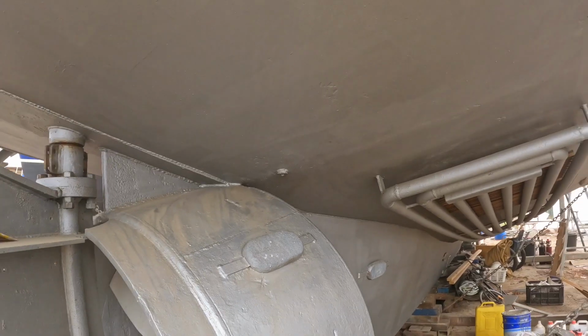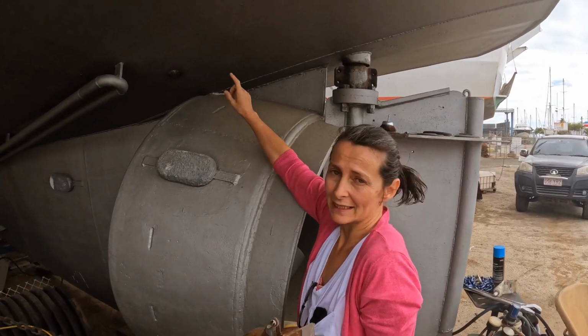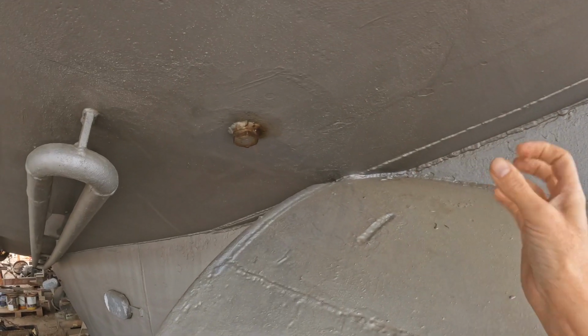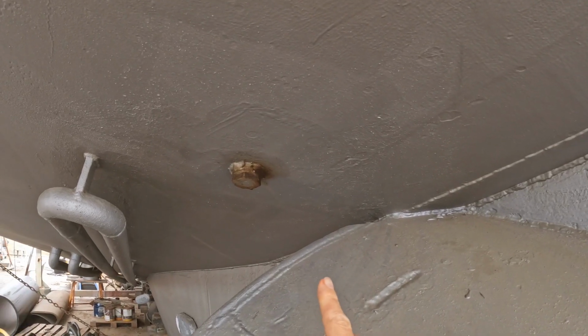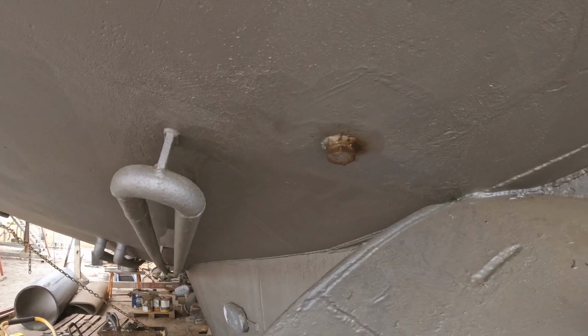So we'll look for that regardless. And that's how we figured out we have a slow leak on this other tank over here. This is what made us think that there's a leak here. You can see the bung itself, all the dirt from the yard has clung to it. That means there was some moisture that it clung to. Around it you can see that it's all dry, there's nothing. But you can see a little run, it's been wiped off, but if you look closely, you can see a little run, and that's the diesel leak.